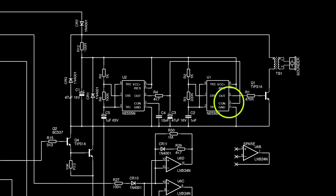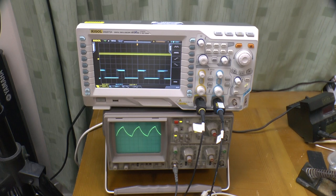This whole circuit has its ground connection switched on and off by Q4, which is switched by Q2, which is fed by PIC pin RB2. As long as the alarm is in either the on or the test mode, I can trigger this by grounding pin 1 of either of the timers. I've disconnected the sounder for now to make it, well, a bit more bearable to test. I'll reconnect that right at the end of the video so you can actually hear what it sounds like.